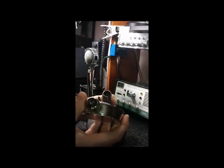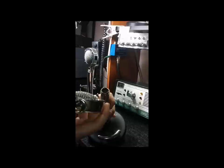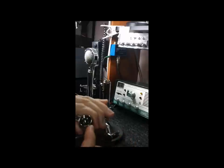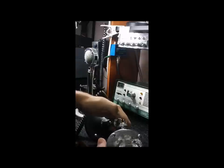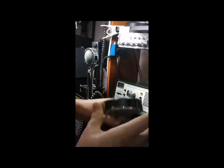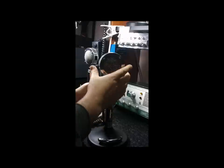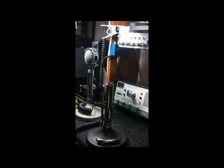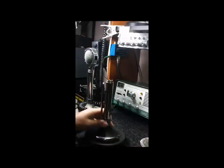I've removed the head. For those of you that don't know, most of these have got a three-pin connector, but I've noticed they only use two. So this one doesn't even have the third one — I don't know if it was broke off or if later model mics just started deleting them. Notice how this has got a notch in it — there's an indention back here on the neck, and the notch and the indention line up. That way you always know you've got it correct, and it has a threaded-on connector. When taking these heads off, you do not want much rocking motion. You basically want to pull them straight off, but you've got to rock them a bit. Don't get rough because you'll break those pins off — I've seen a lot of them with broken pins.